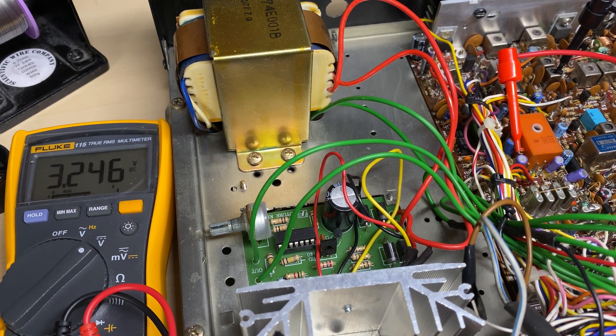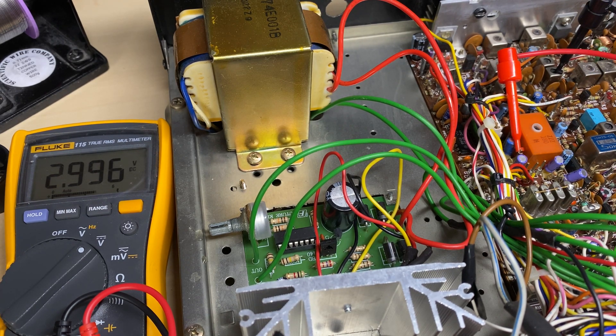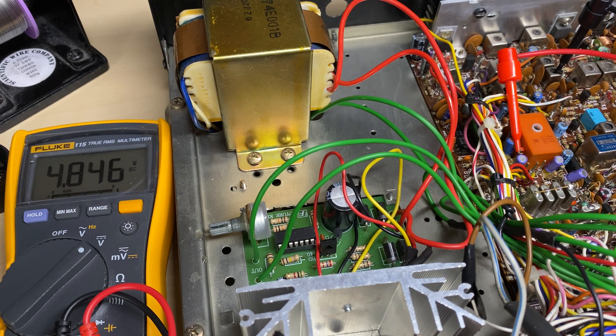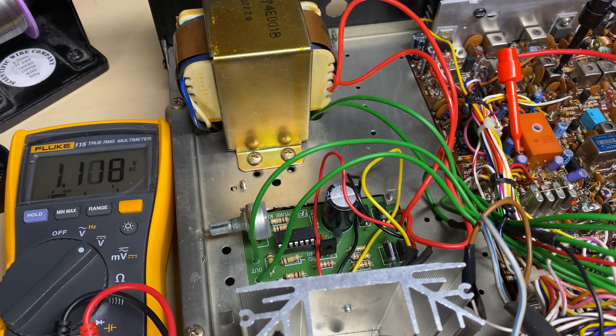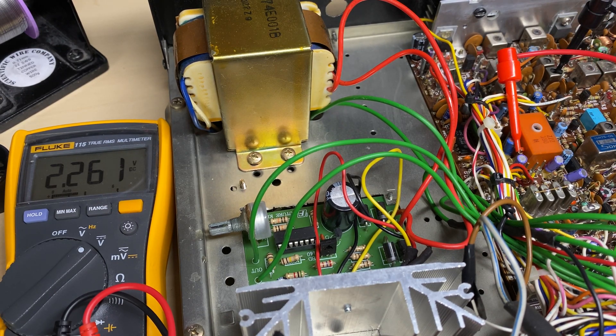After a little bit of fine adjustment going up and down the bands, we seem to have something that resembles a good VCO voltage across all the bands. It's a little finicky to adjust but we'll do the final adjustment once we actually get the radio working. Just checking all extremities and I think we've got it into a workable condition — except when it shoots up to 5.6 volts again.